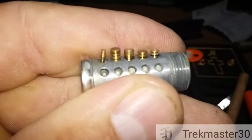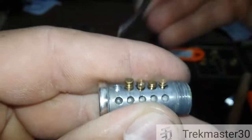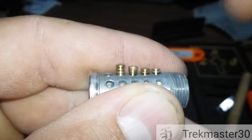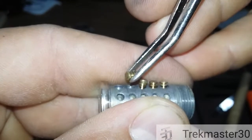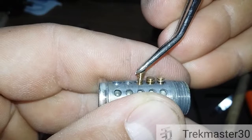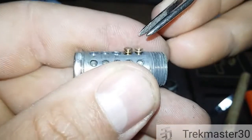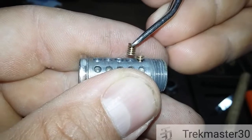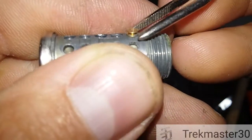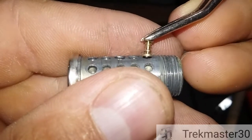Number one had a drunken spool way below the shear line and a counter-milled plug. Number two is a serrated, heavily — well below the shear line with a threaded chamber. Number three is this funny kind of serrated spool with counter milling. Number four is serrated — heavily serrated, well below the shear line — with a threaded chamber. And number five, the one giving me trouble, is this funny little spool with little notches in the middle.